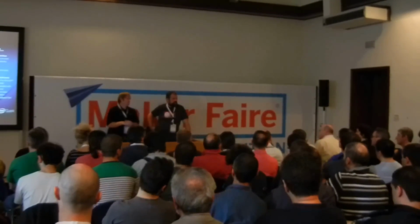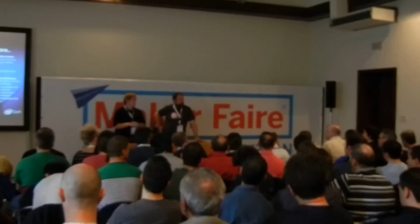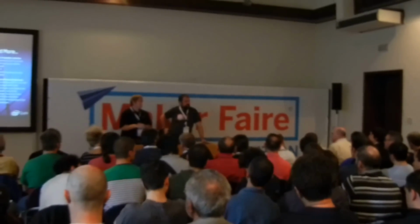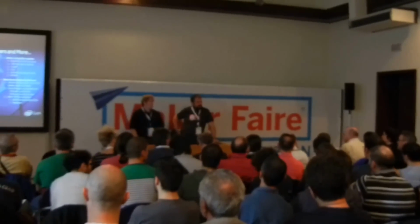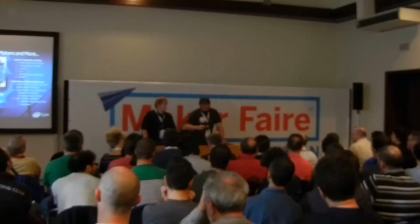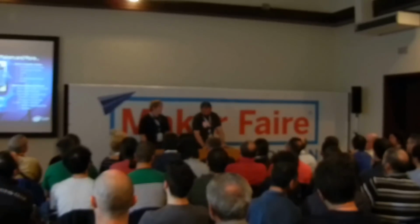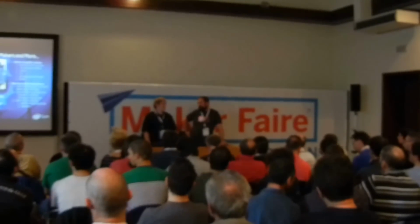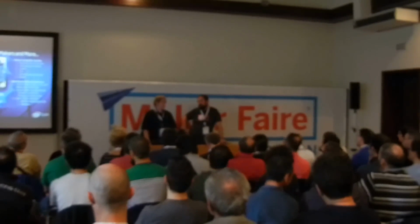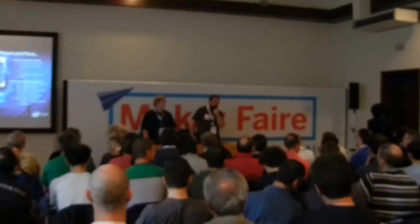Second question: a lot of evaluation boards put out by larger companies often don't ship with a true MAC address on the device. They randomly generate it, or you have to assign one specifically. Are the boards being shipped with a unique assigned MAC address for everyone? Yes, and the MAC address is on top of the PCI Express connector on the back. You can also change it in firmware to hardcode something else, but we try to use the platform data as well.